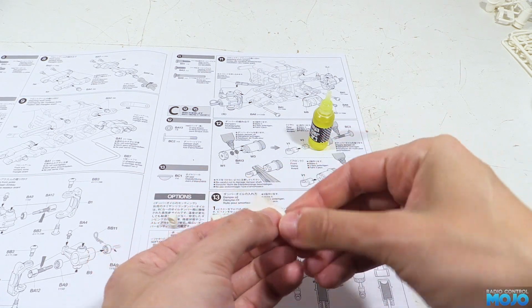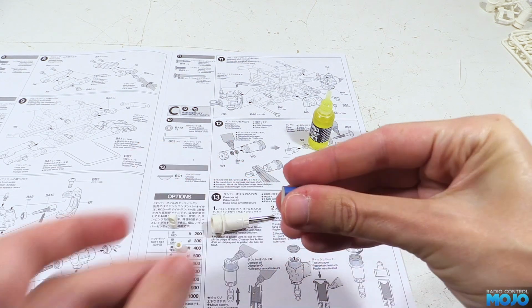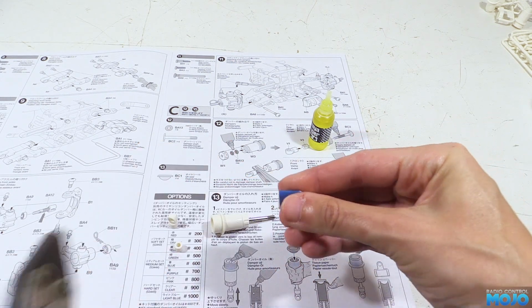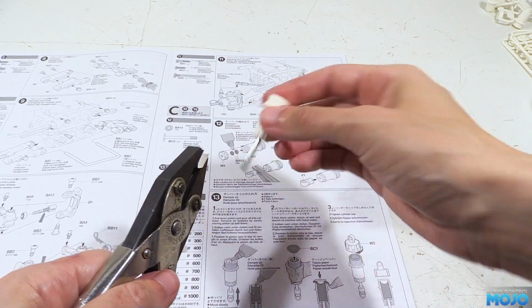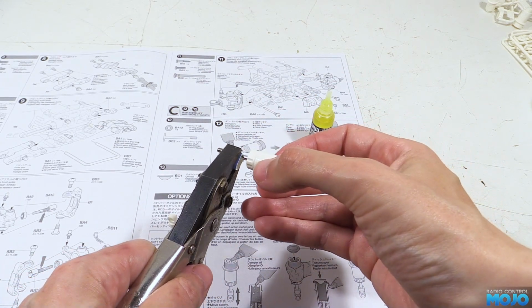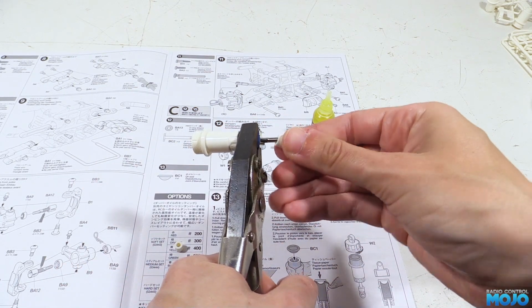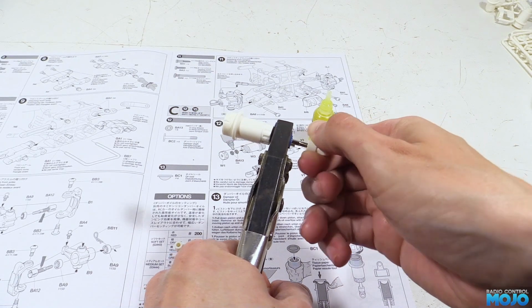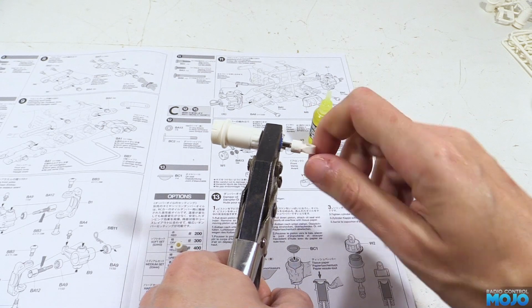We're going to need to grip the rod to stop it from turning. Now it's absolutely critical that we don't damage the surface. Any scratches or marks are going to wear the O-rings, causing a leak. You can get a proper tool made of a very soft metal or soft inserts, but we're going to use some pliers with some cardboard to protect the shaft. You still need to be careful of course, but the card will add just enough protection.